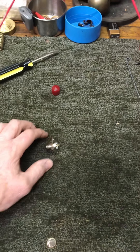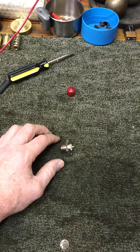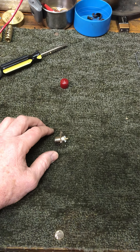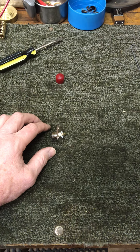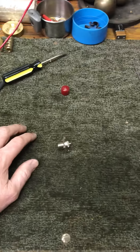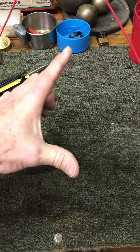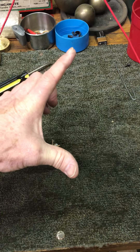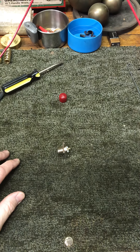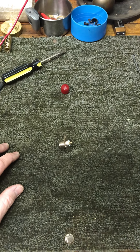This is primarily for guys that are new to ham radio and probably just hold a Technician class license. You're probably operating on the two-meter band, 144 megahertz, and your first radio is probably a handy talky walkie-talkie type radio. They come with a little short antenna — we call it a rubber ducky antenna — that's about six inches long, and it's sort of a compromised antenna.